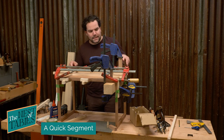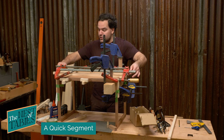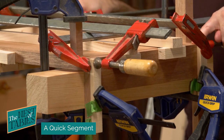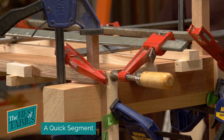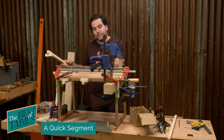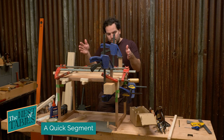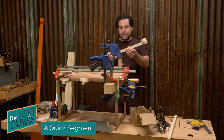What I've decided to do is put my metal clamps - that I can adjust and get the most force or the most precise force - around the joints. That's self-explanatory. And then what I've done, because I didn't want to start banging in a load of heavy metal clamps around this thing, is - before you know it the legs look like a newborn horse, all splayed out, and I don't want that. We need to keep everything square and it's very delicate, so I've made a load of these, and I do this quite often.